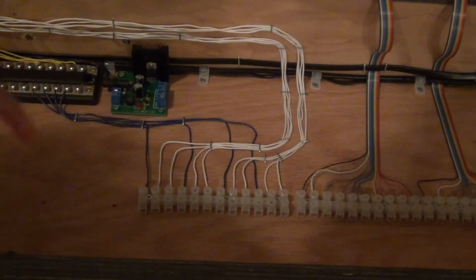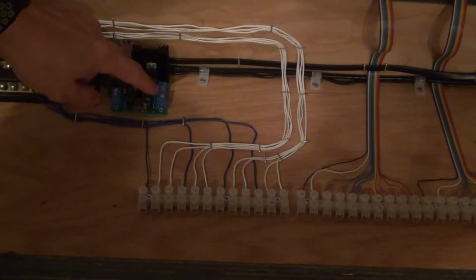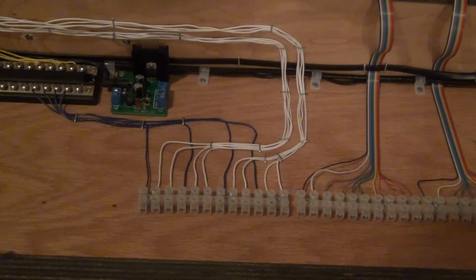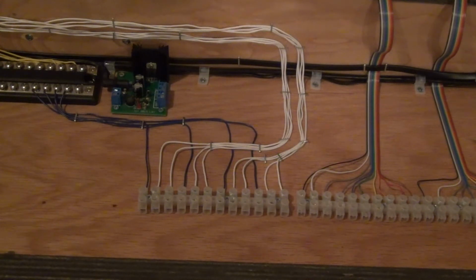Now the other thing is, I know I'm never going to use anything else with this particular layout, but the nice thing with this power supply unit, it actually has 2 positive ports and 2 ground ports. So if I wanted to, without having to rewire all this and add resistors to those wires, I could just run a second wire off of each of these, get a separate bus bar, and everything would be fine. So there are some options with this particular model of power supply, but in the case of this particular application, I'm going to go ahead and get this soldered up and do the resistor straight off the potentiometer. So I'm going to go ahead and get soldering.